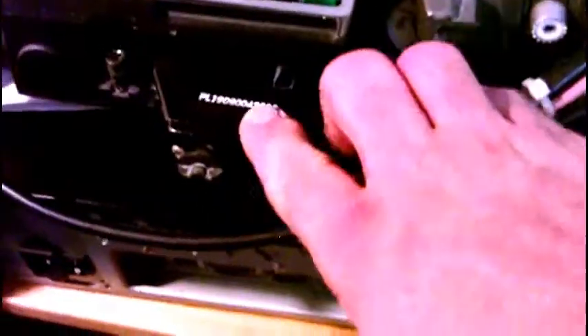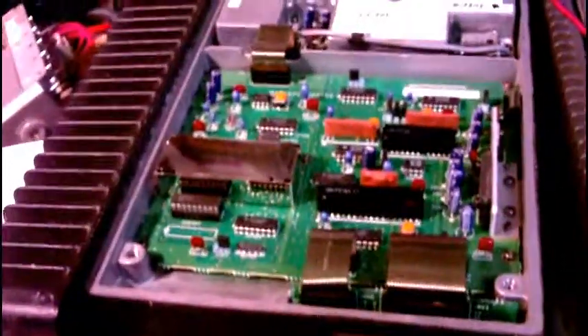You also need to build what's called a RIB — a radio interface box — as they call it in the two-way industry. This is a homebrew one. At one end you've got a parallel port which you plug into your computer to do the programming, and at the other end I've connected eight wires to the control cable. When programming, you just plug it in here, connect the board to the computer, and send a 256-byte hex file into the EEPROM — it's called an X2212 EPROM. I'll show how to do that in the radio modification video where we take one of these from the commercial band down into the ham band.